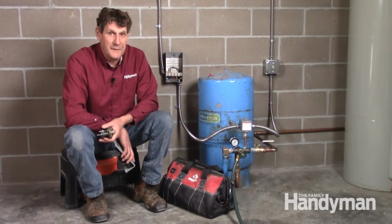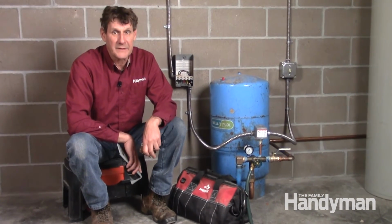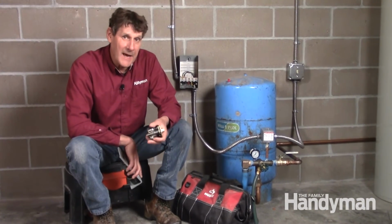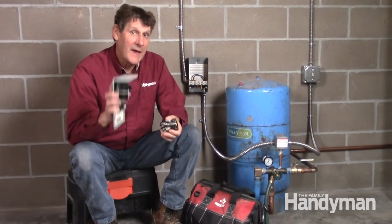If neither of those two fixes got the water running, the problem is outside the house, and you'll need to call in a well expert to track down and fix the problem. But most of the time, replacing either the pressure switch or the controller will do the trick, and you'll save the cost of having a pro come in to do it for you.